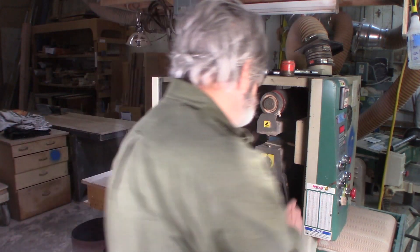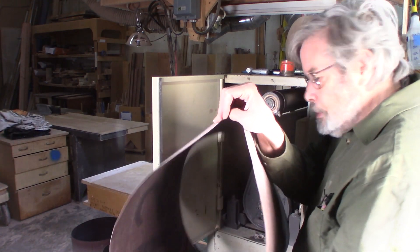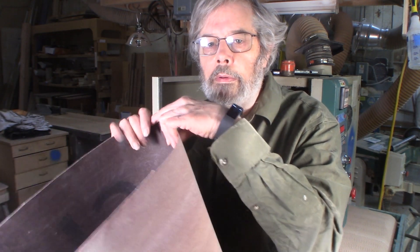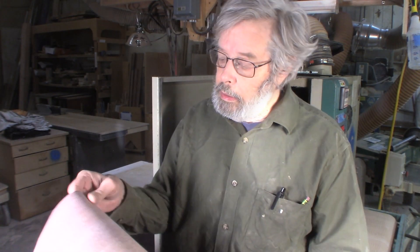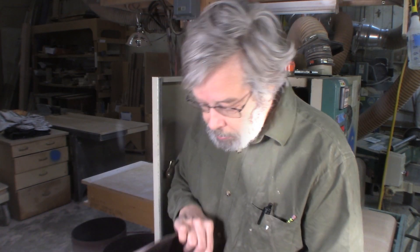Take the belt out — that's how you take it out once you've got it opened up. Then you have to look inside and look for the numbers. If you get one of these belts out and a new one, it needs to be marked because the marks that are on it wear off completely. You cannot really tell if that's a sharp 120 or a dull 80 grit. 80 grit will cut deeper. So you usually want to take it out and check it. It is 120 and it's in decent shape, so it gets to go back in.